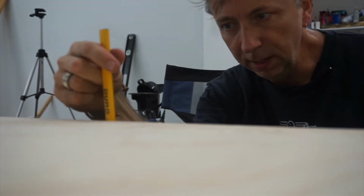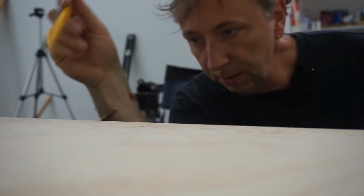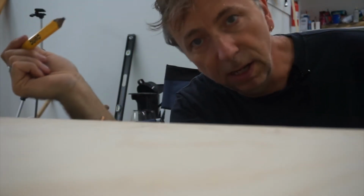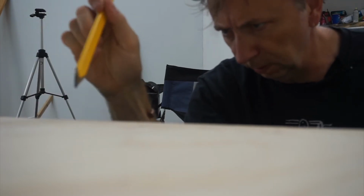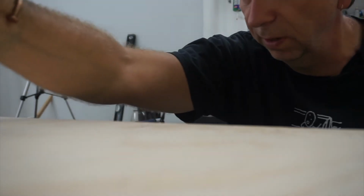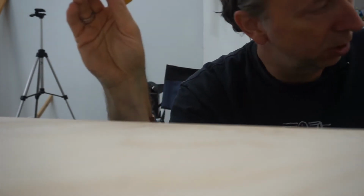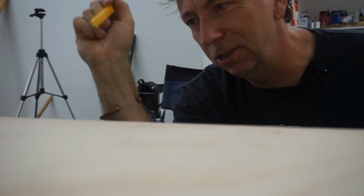This bottom piece right here is the one that's going to run in the bottom of the front channel of the trailer. And that I've measured to be exactly 59 inches. So we're gonna go from this point where we start to go vertical, we're gonna go over 59 inches, figure out where that is, and then we're gonna mimic this 1 foot up, 9.5 over thing that we did here, and that's gonna form the bottom section of the front driver direction hitch end of the gypsy wagon.